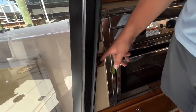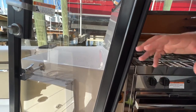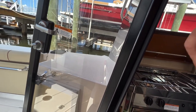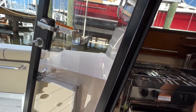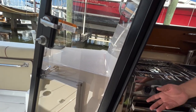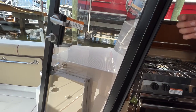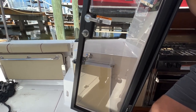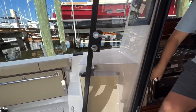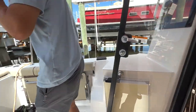This propane detector sensor is actually behind there and a little bit down. And if the batteries are charging, they emit fumes. And this thing picks up those fumes and the alarm will go off from battery fumes. Not something you smell, but it does. It can go off if the boat's closed and the battery charger's on. And after a couple of days, it sometimes does go off. But once the battery changes, we'll see if it still does it. It has a mind of its own. But even so, you pull the fuse, and I assume the fuse is in here. Down there, yep. But that's on. So let's come back here.